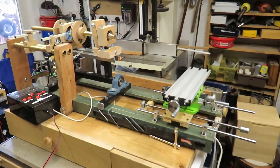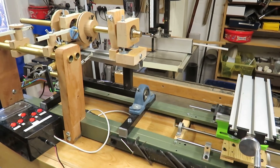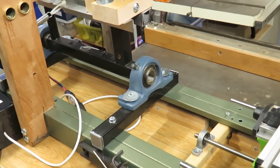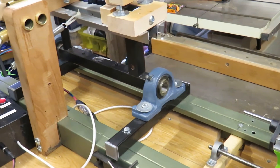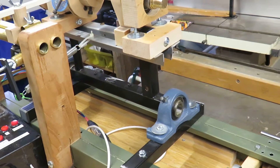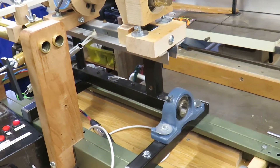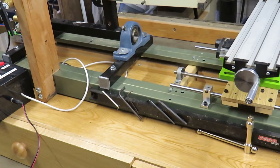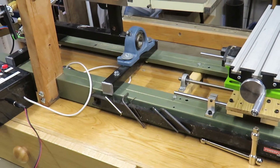The basis of the machine is the rocking headstock. This sits on two pillow bearings bought from Banggood, a Chinese website, for about £12. The black U-frame that supports the main shaft and bearing came from an old bed and I thought would make a good basis for an ornamental lathe. The green bars are the sides of the bed cut into two strips, and the black crossmember is also part of the mattress support.